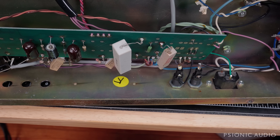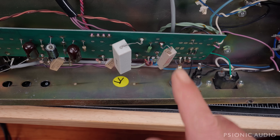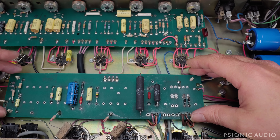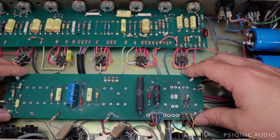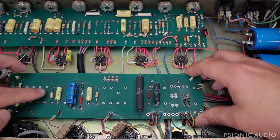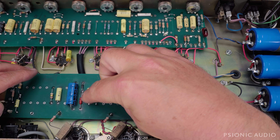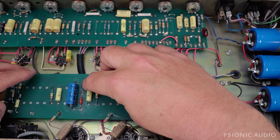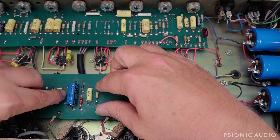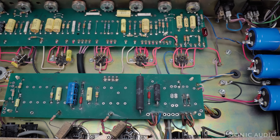I think I'm going to change this stuff on this board before I finish that filter cap wiring — it'll be neater this way. Everything's repopulated here. I cleaned up a lot of flux on both sides of the board. As you saw in the previous video, a lot of the original joints on the other side of the board were really, really bad — those have been redone. This cap's been changed out, these two caps been changed out. All three components in the bias supply have been changed out: a new two-watt diode — a 1N4007 — a new 100 microfarad cap here, and the 56K resistor has been removed. I've added a bias pot that I'll show you in just a minute.